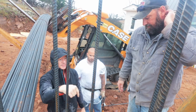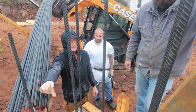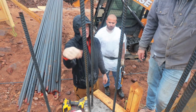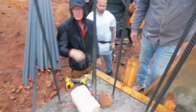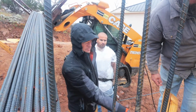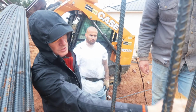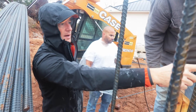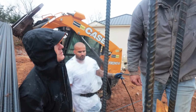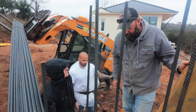Okay. And this is going to be a lower pour, because this is a porch, right? Yeah, so we're going to have it step down an inch or two, so if any rain gets on it, it'll shed off. And this will be a broom finish for the porch. Actually, the porch goes in a little bit. Does that make sense? Cut that off straight. Cut that one off. Probably 1, 2, 3, 4 of them. Probably right where you get to that batter board sticking up, that's getting pretty close to being correct, because the rock goes all the way down there. Make sense?